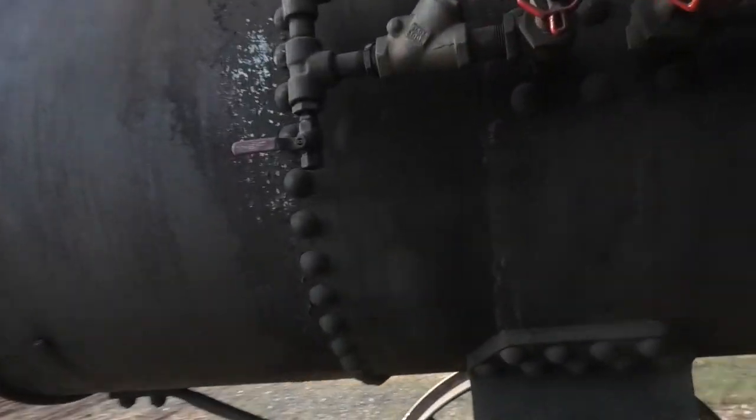Now, the boilers themselves, were they manufactured in such a way that they could be easily replaced? No. A boiler for an engine like this, to take it somewhere, would be between $60,000 and $80,000 to put a boiler on it. Wow. They're all hand riveted. Very, very time consuming to build a boiler. Yeah, you can see some of the rivets here.